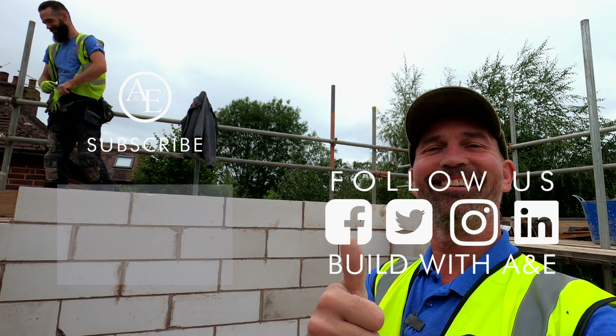Always be very aware when you renew fascias — whoever's going to do it for you, make sure you get that 50mm overlap that should be there, because that 50mm from the fascia line is so important.